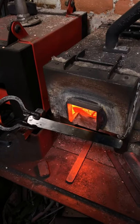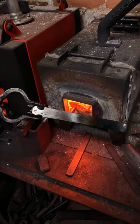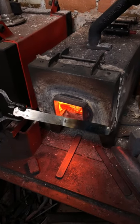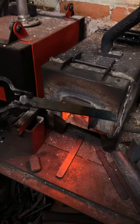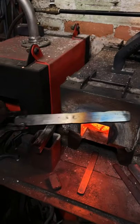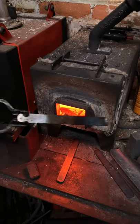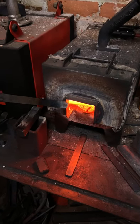This is kind of interesting. We talk about knife making and a lot of tool smithing, especially if you're in the oven, my heat treat or my temper cycles will be very, very long. So like 2 hours plus for a temper. And often I'll do multiple cycles, almost doing these flash tempers, as it's almost referred.